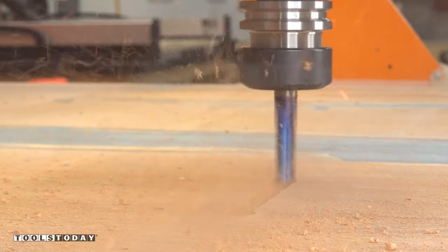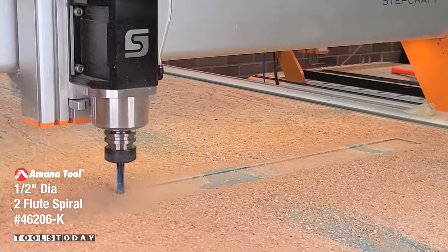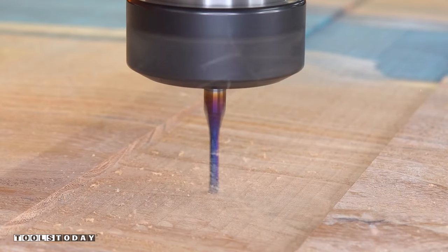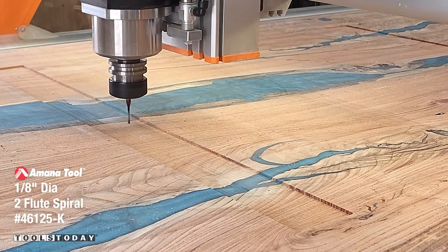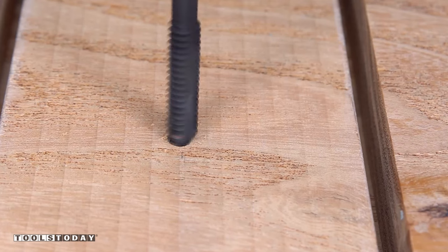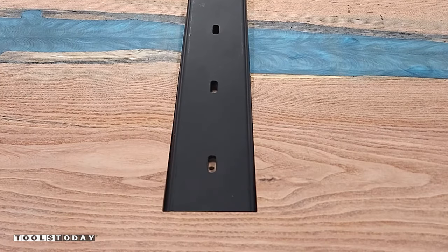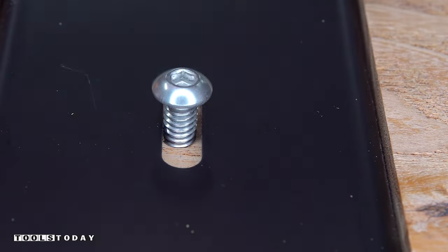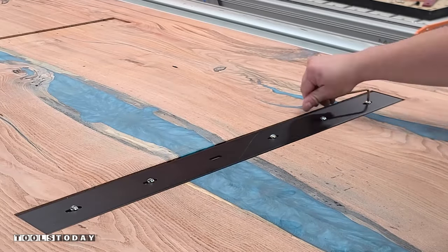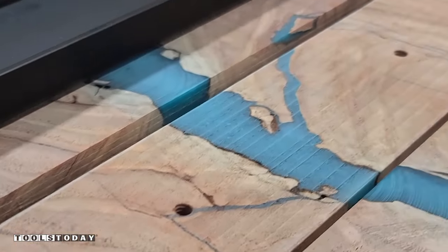While we have it on the backside, we're going to install some C-channel to help ensure that this stays flat. I'm using the 46206-K one-half inch down-cut bit to cut a pocket the size of the C-channel. I'll then use the 46125-K one-eighth inch up-cut bit to drill some holes where we're going to thread into. I tried a threaded insert on a test piece but it actually broke, so I figured the wood should hold the threads just fine — and it definitely did. I cut a slightly oversized area so the C-channel can move back and forth within the pocket to allow for wood movement, providing nice support to keep the slab flat. I installed two of these so the entire piece is nicely supported.